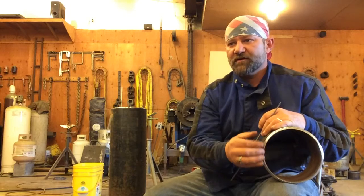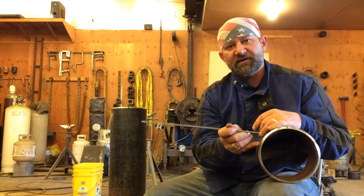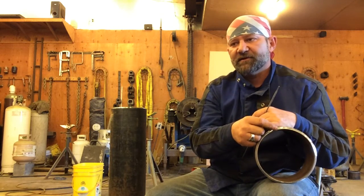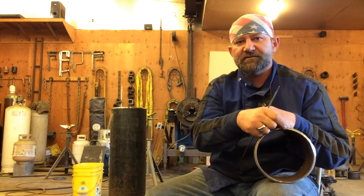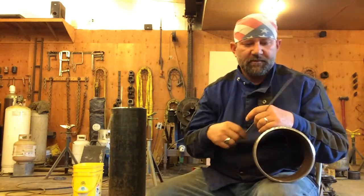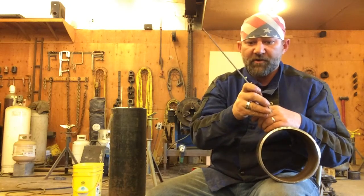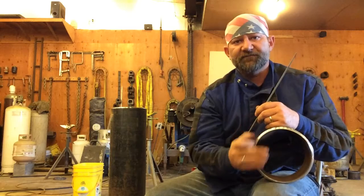If your space is too tight, you might have to stop and use your grinder to do what I'd call softening up. You might have to use your grinder to remove some steel, some material, so that you can get that arc through there and get a keyhole. Now, your starts and stops and tacks are going to have a heavy place where you started and a keyhole where you stopped. You don't need to grind the keyhole where you stopped a whole lot. The heavy start of a tack, you need to grind that kind of like in the shape of a ramp. You want to grind that heavy starting area down to where you know that when you go back and light up an arc on that tack and come into it, you can reach in there and get the fusion between those lands.